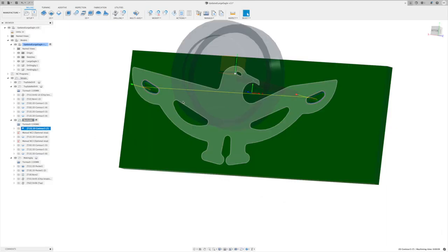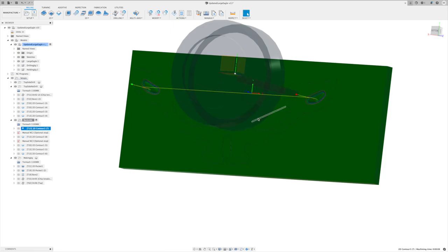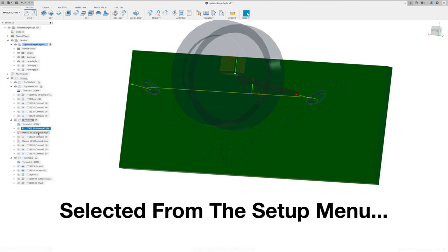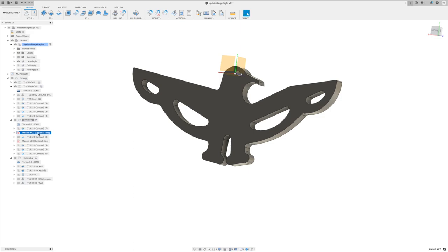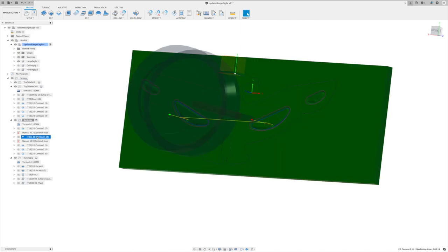So it's going to first go in, and it's going to put the contour in these first two. So we're going to flip it over and I'm going to bolt it in these large cutouts in the wing. I'm going to bolt it down there and it's going to put the bevel on the small ones. And then I put in a pause here. I put in a manual M01 break so that it'll pause so that I can go in and move the bolts. So then I'm going to take the bolts out of here and put the bolts into the outer portion